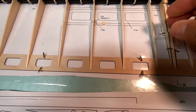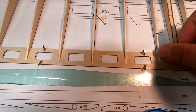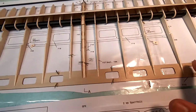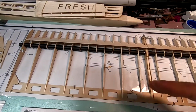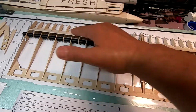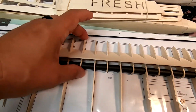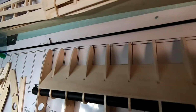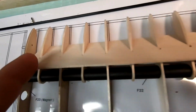like so, just to hold that down against the edge here, because that's all I'm concerned about, is getting these squared and attached. So these will get glued, and then I move on to the leading edge while everything is pinned down, and then I can glue the spar. Now you'll notice that some of these items are not in line with the plans. Just a moment. You can see that this is almost a rib width over by the time we get out there.